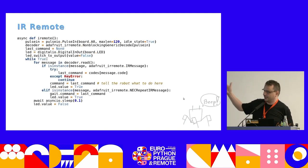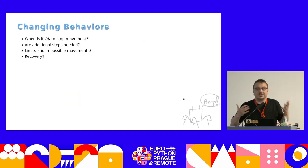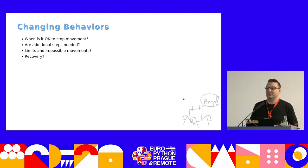The small robot is controlled with a remote. There is another library for that. The way it's implemented, we have a small library in C that runs in the background, collects the signal from the remote sensor, and caches them in memory. Then we periodically call decoder.read to actually decode those signals and decide what to do. As you can see, you can easily add more behaviors and more functionality to your robot this way, without having to rewrite your code completely every time.